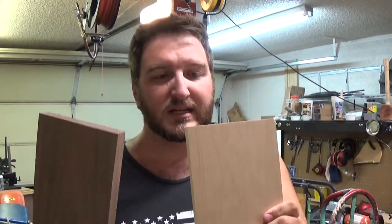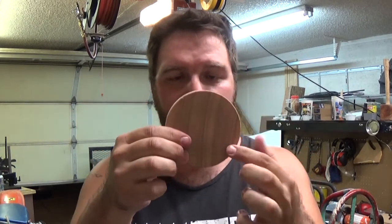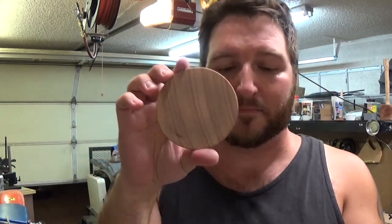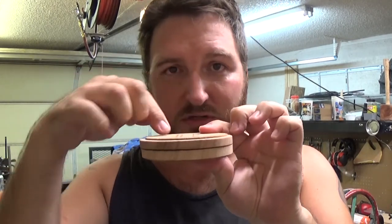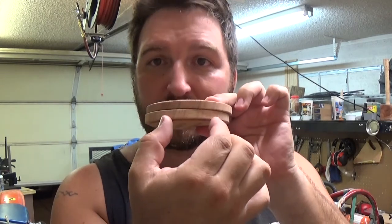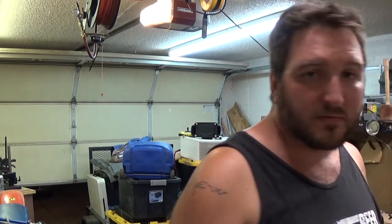Here's the plan: I'm going to laminate some pieces together. I've got walnut and maple. I'd like to have the outer parts be maple on the edges and the middle will be walnut. We'll have two pieces with the grain going the same direction sandwiched together. The top portion — this is only about three-quarters inch thick — will be the playing surface. Underneath will be support, but the center walnut section of the bottom will slide out as a drawer, because I don't think one thickness will give us enough for both a play surface and a drawer.